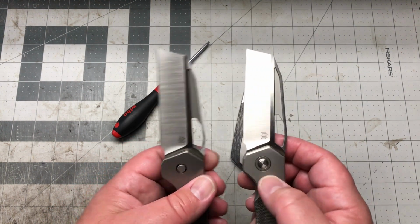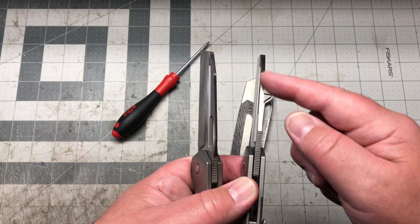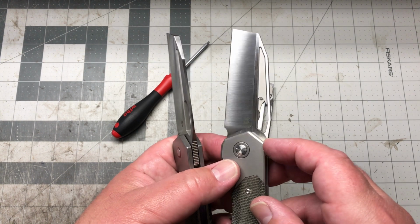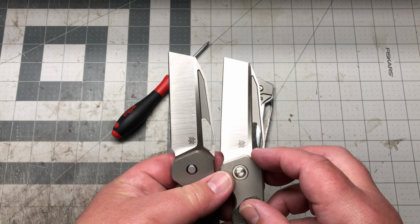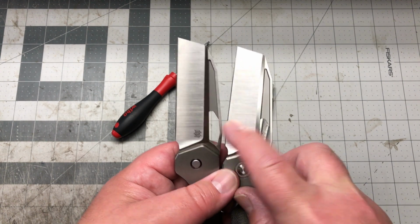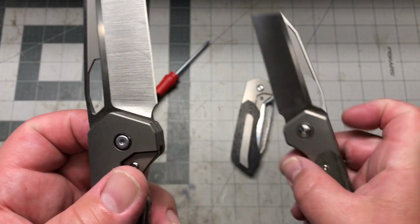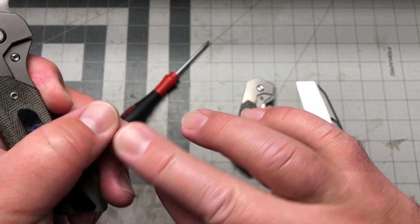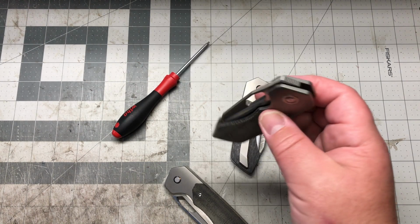So, and that's another thing too. So when we thickened the blade back to where I originally wanted it, I didn't want it this thin at all, right? When they CNC the blades, they chamfer this inner edge, and when they did the grind too thin up here, it takes away the chamfering. So these edges right here were super sharp. Like they're nail biters, you know, like they scratch your nail. So that was immediate too when I first got the round one Protos.